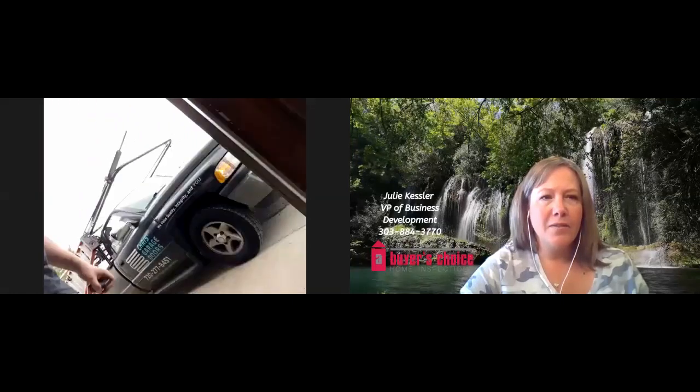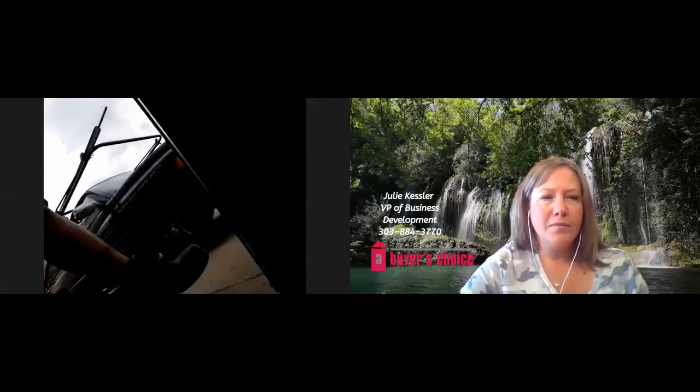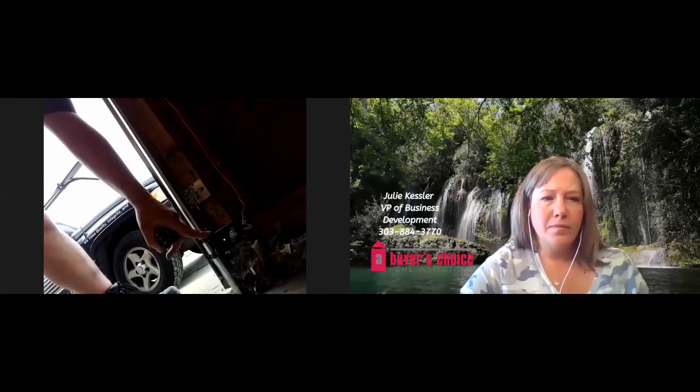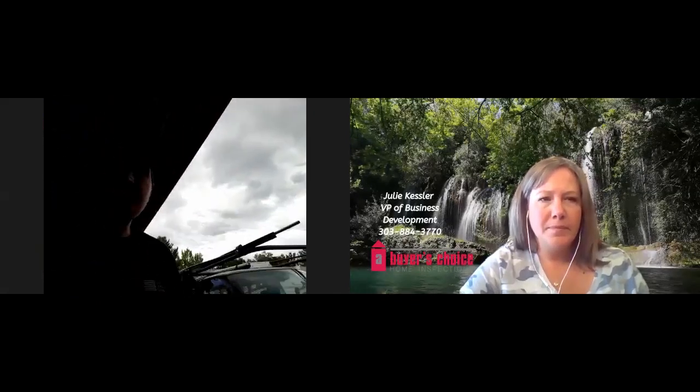I'm going to stand this way. You can see me. You just push the button on your remote, and then you throw your foot across the sensors here. You can see my foot. So here's a sensor at the bottom. And you'll see my door actually went right back up.